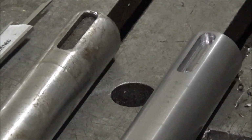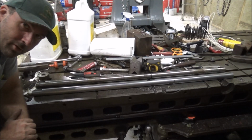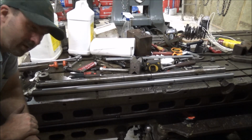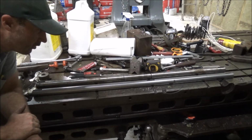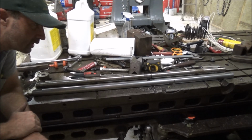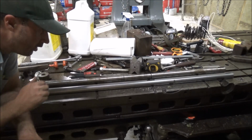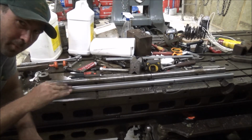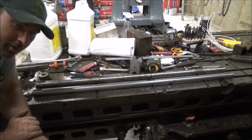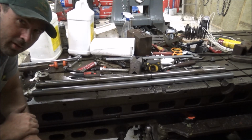Well, one I did, the other one's on the broken shaft. So getting these keyways to come out where they're a good tight fit is what I was looking for. I'm pretty tickled that I was able to do that on this machine because you're pretty much holding less than a thousandth on width, and I had to step over to do it because of the 375 diameter cutter cutting the 10 millimeter keyways. So it worked out.